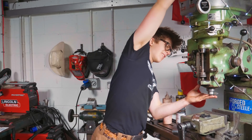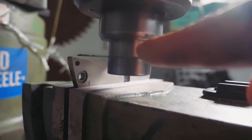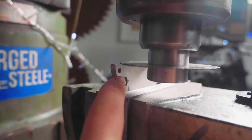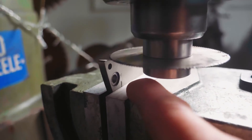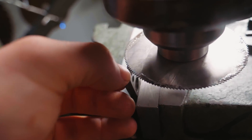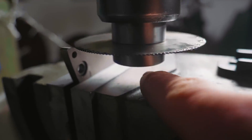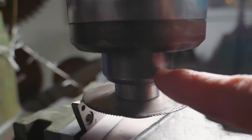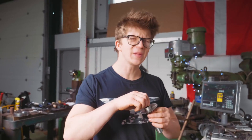But I'm not going to tighten this up right now because there's a big problem with this arbor. Firstly, the slitting saw's on backwards, so I'd have to run it in reverse to cut. But secondly, when this is down to the height it needs to be, this is so close to touching the vice jaw - so it would be fine until it reached the back of the vice jaw, at which point the saw would only be partway into the material. By being so far out on the slitting saw, the angle's cutting way far back, and it'll end up cutting into the counterbore I made for our bronze washer. Not only is the bottom of our tool going to be running into the vice, but the actual Bridgeport quill that the collet goes into is going to impede how far in I can cut. So we're going to have to do a little lathe turning to make something that's going to work. I need at least 30 millimeters of clearance.